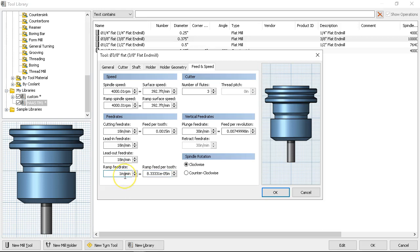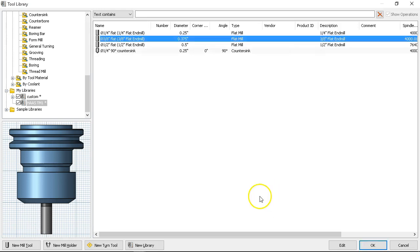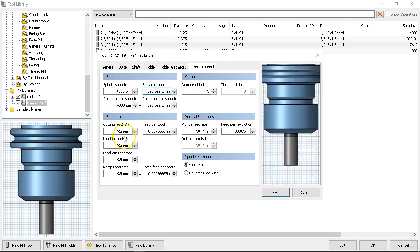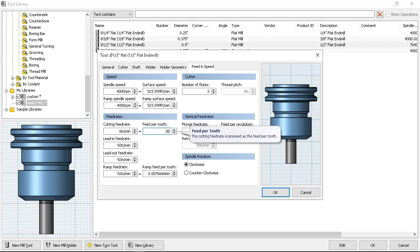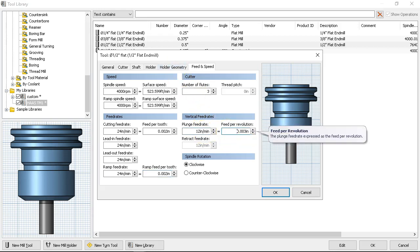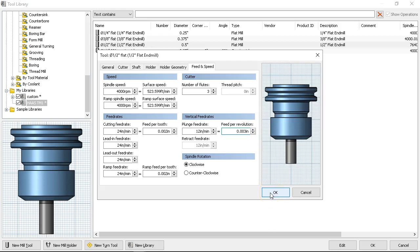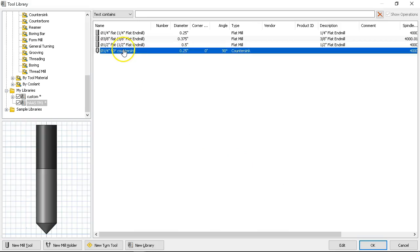18 is about borderline of what I'd want to plunge. The half-inch — we'll slow down the feed rate — let's go with two thousandths on that one. So 24 inches per minute is going to be pushing that machine a little bit. We would see spindle loads approaching — depending on radial and axial engagement — approaching 30 or 40%. For a light-duty machine, I really don't want to see much over 50% at max. So 40% is a good safe number.